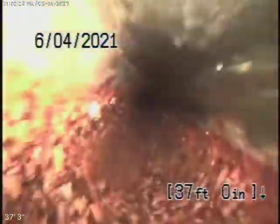You've got two options over here, either of which definitely is going to need a clean out outside of the house. Best to put a two-way clean out. You could run a cable with a blade through this, maybe descale it somewhat, but you definitely need a clean out there. Otherwise, you should just replace this cast iron pipe over here, because it's definitely getting a little old. But it's functioning, doesn't have any breaks or anything.